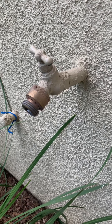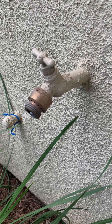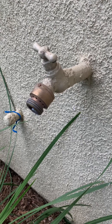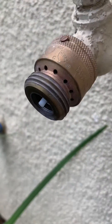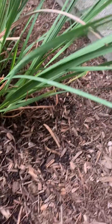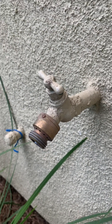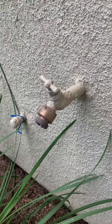Here's how it works: you have your hose connected up there, say with a little spray handle on the end for washing your car. When you shut it off, water is going to spray out those little weep holes — and it's supposed to. That water will shoot right down onto the ground, and it will keep it from going back into your house.